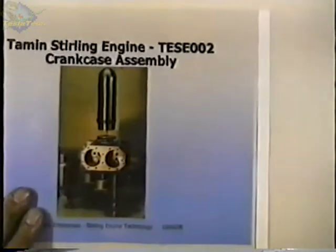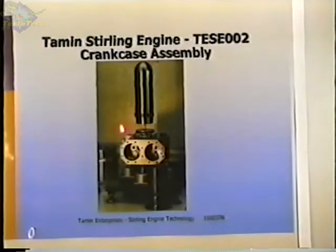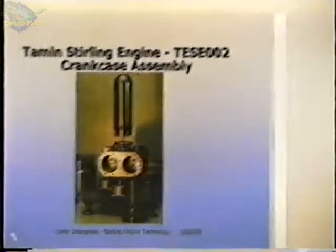This shows some of the internal components. This is the displacer. It's a long displacer, over 7 inches long, and this particular one is made of stainless steel. This is the seal at the bottom of that displacer. And then here's the power piston. It's a little flat aluminum piston with an O-ring seal on it. This is the crankcase, the rhombic drive mechanism. You can see the two connecting rods for the displacer and the end of the crank pins. It's a cantilever type crankshaft. It has needle roller bearings on the crank pin end and ball bearings for the main bearings. There are two ball bearings on each crankshaft.